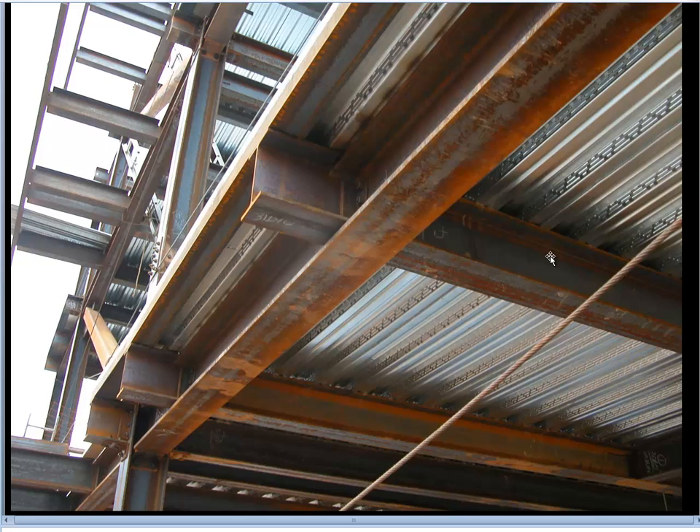The composite action between the beams and the floor turns out to be quite important. You'll notice that the corrugated decking extends beyond the final beams in the column grid, and to support it we've got these stubs of beams that are welded on. This is an edge angle resting on top of the end of the beam — that edge angle provides the formwork for the concrete but also provides a sturdy edge to which we can attach various things such as clips for curtain wall connectors.